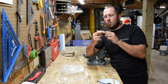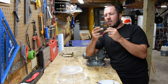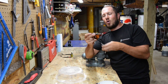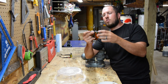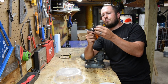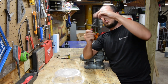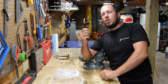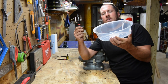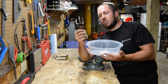We're going to set this for 5 inches. You need to set it on both sides at 5 inches, or you'll get a different size hole altogether. I've set it on 5 inches, dropped the drill bit in — it has a quick lock chuck on the bottom. Let's put the shield on it and get it up on a piece of drywall I've mounted to the ceiling, and we'll show you just how easy this tool is to use.